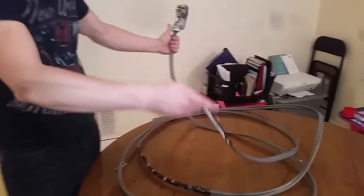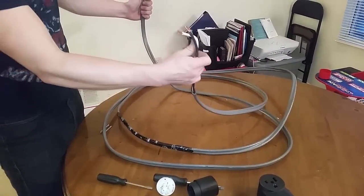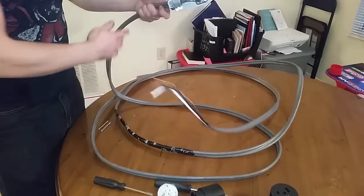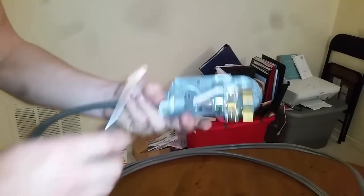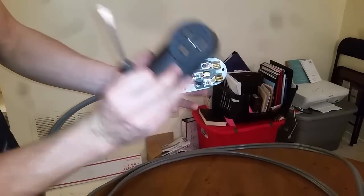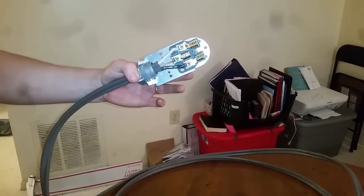The first thing you're going to need is to buy the cable. The cable is several dollars a foot. You're going to want copper — aluminum can be used but it should be avoided. Copper is better. Second, you're going to need to buy a plug. For my welder I needed a 50 amp plug. Whatever your welder requires, find that spec and buy the plug. It's going to be $10, $12, maybe $15.